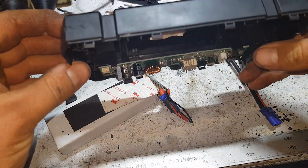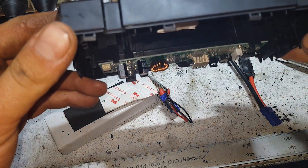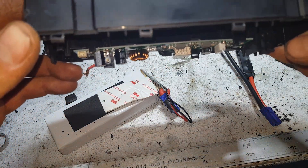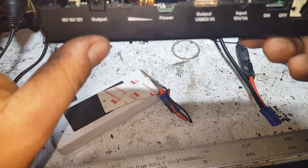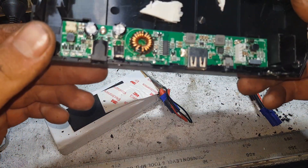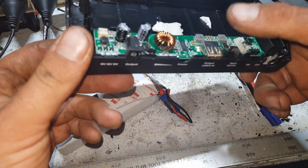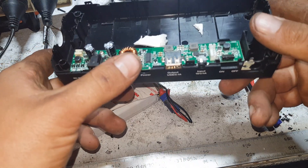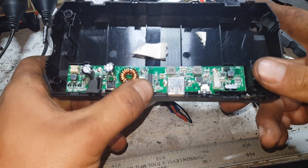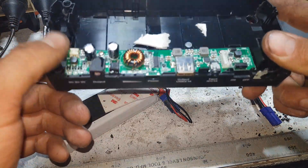As for the rest of the circuitry, there's bugger all in it. It's not really double-sided — there's only a few components on the backside: choke, output, couple of capacitors. So there's going to be a charging circuit, a balancing circuit, USB power, a little module that's smart enough to change through a few different modes, voltage output, LED driver.